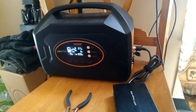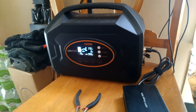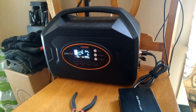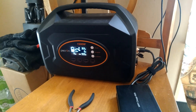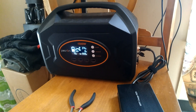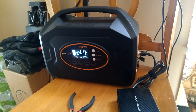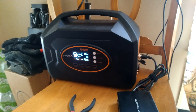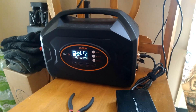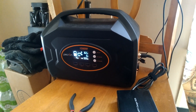So there you go — an update on the PECRUN S1500F. It's a decent unit. This charge controller isn't on the quality of my EcoFlow. My EcoFlow, if I put two 100 watt panels at 44 volts on it, it maxes those out at 200 watts, just like it maxes out the 400 watt panel. The EcoFlow definitely has a better MPPT charge controller. But this one, at lower wattages it behaves like a PWM charger; at higher wattages it performs like an MPPT charge controller.